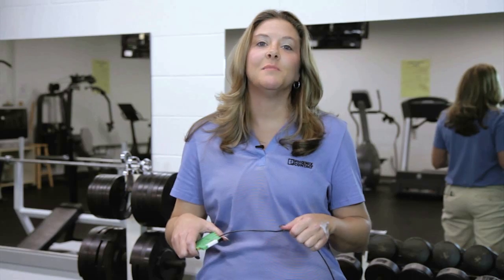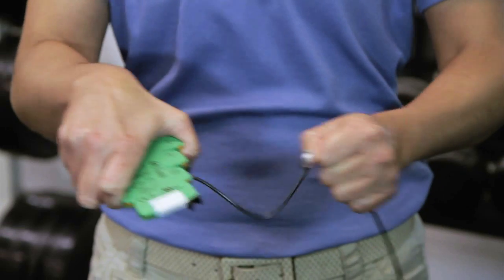Hi, my name is Tracy and I'm the Relay Product Specialist here at Phoenix Contact. Welcome to our series of tests that we're conducting on our PLC Relays. Our PT Relays have push-in termination technology with awesome retention force — it's five times the IEC requirement. This means a ridiculous amount of force is required to pull this wire out.